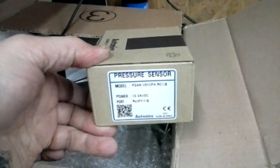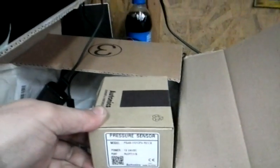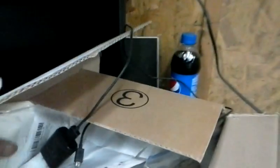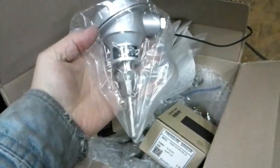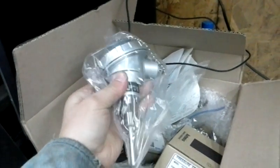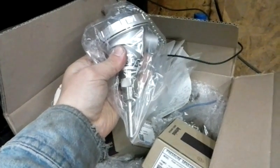While we're talking about RTDs, these are the pressure sensors — I'll show you a quick shot of this. Stuff was showing up at my door from all over the world; this particular box is from Korea. This is what the RTDs look like: they have NPT threads on them and there are three wires inside this aluminum cap that unscrews and comes off. Those are going to get hooked into those cards and the PLC, so the cards basically tell the PLC what the temperature is in the different places they're mounted.